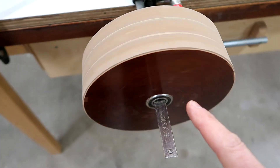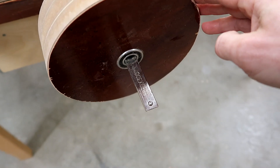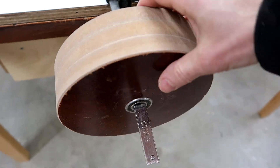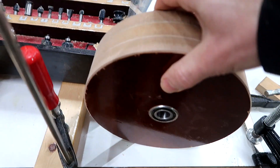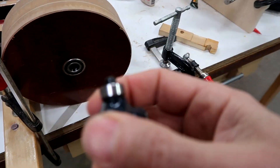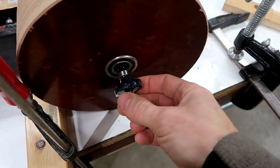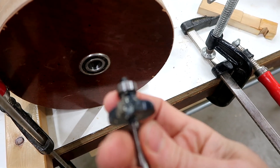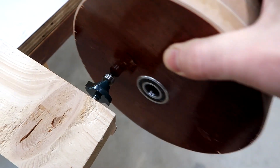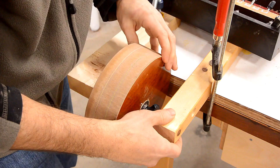I realize this wheel is a little bit out of balance, but the problem is these bearings don't turn easily enough for it to rock back and forth, so it's hard to balance. What I was thinking is to just roll it on bearings from router bits on the inside, and rather than make a special jig and take the bearings off the router bit, I can just use two router bits and put the wheel in between those two.